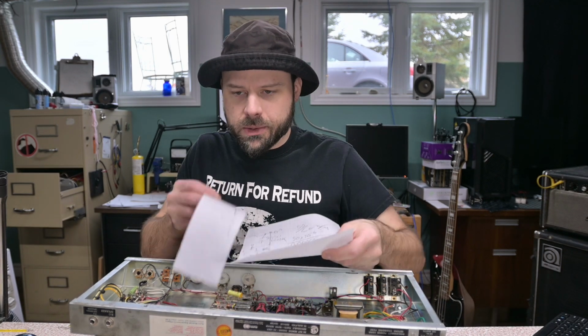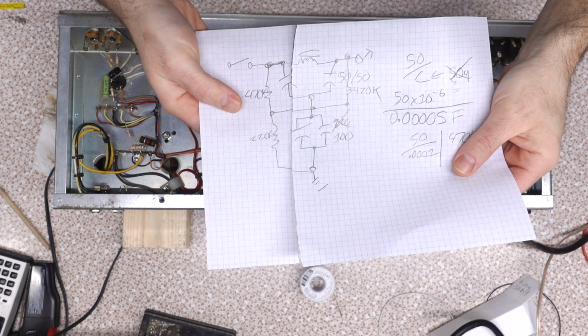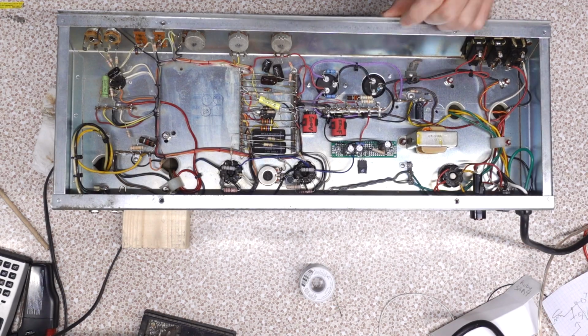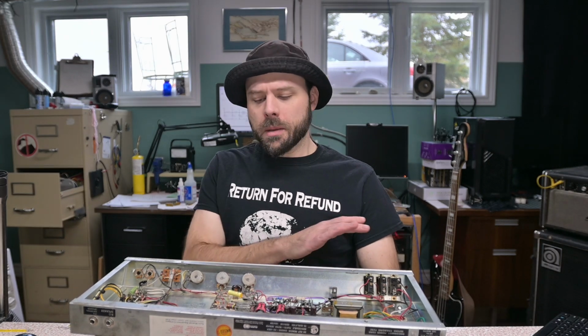And because I'm using this, you know, parallel series, the sheet got ripped up, where basically I put two capacitors in series to handle the higher voltages. It could virtually be seeing 100 UF for a split second before the capacitors balance. So yeah, you try to pull too much current all at once through the rectifier tubes.